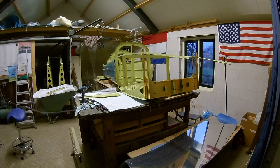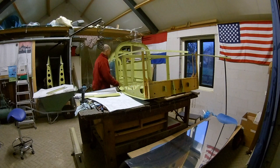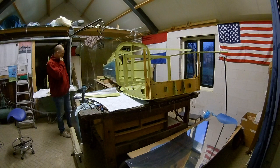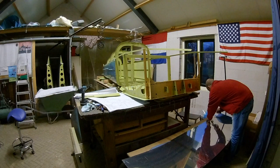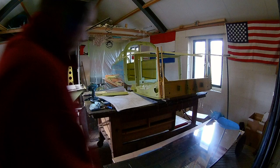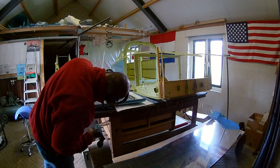I removed the longerons for that. I separated the center section from the tail section, so now it's again two different parts. I have to countersink and dimple all the parts, cleaning it up, scuffing it, and then start working on the priming. Here I do some extra work on the bends of the side skins, making small adjustments on things I thought didn't really fit well.